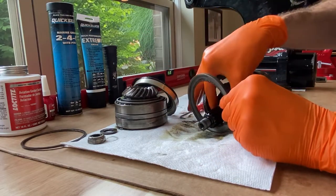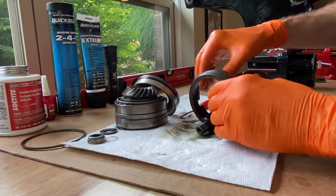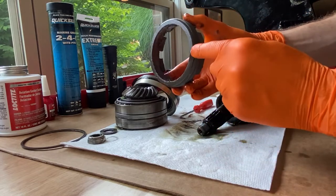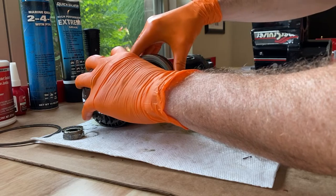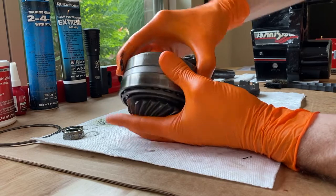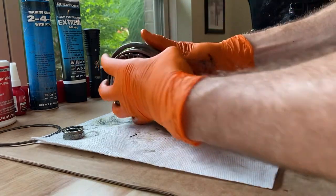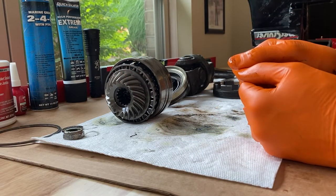Pull off the additional race, set that and reconnect it to the oil seal race, and now pull the retainer nut off. Very dirty — we are going to clean it up and reuse just this retainer nut. Be very careful so you know exactly how this goes back together. You'll notice I can remove the bearings from the actual gear here, and vice versa — I can press them on by hand. However, with the new gear I actually had to get it factory pressed by my local marina.